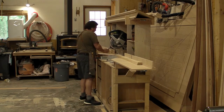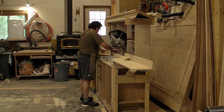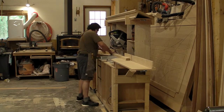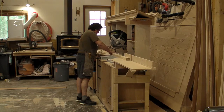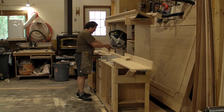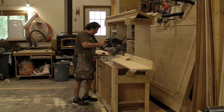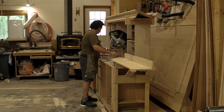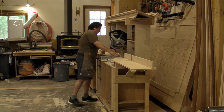Then what I do is I put the two pieces of pine up against the stop block so that I can take the wood that will be toggled soon and put that right up against the pine. Then I remove that pine, hold the new stock, and move the stop block over that 1.5-inch-ish. It's actually pretty close to dead on. I could have just marked it, but now I know it'll be an exact measurement. I have 4 toggles in this flat.